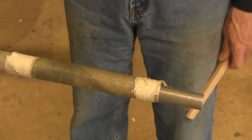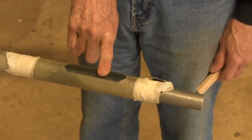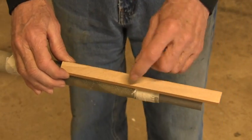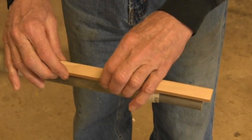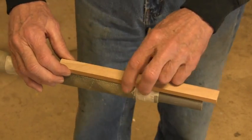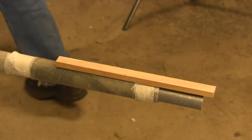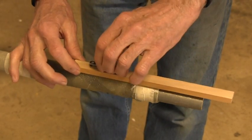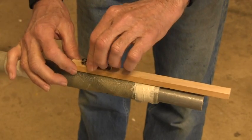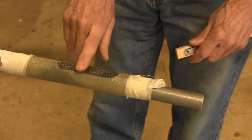I had a brain fart this morning as I was walking. I know the metal is probably going to be stronger and we'll do the drilling and test screwing of a piece into here, but I got to thinking that maybe it's much easier to take a small piece of wood — this is maple — and then shape it so it conforms, put a little radius on it, and then glue and epoxy it on. It'd stand a little bit prouder, rounded out, so you can stick one of these things on here. It wouldn't have to be that big, just big enough to give it some wood on each end to keep it from splitting out. You can see how much thicker it would be, so this is a much cleaner approach, but it might be a pain.